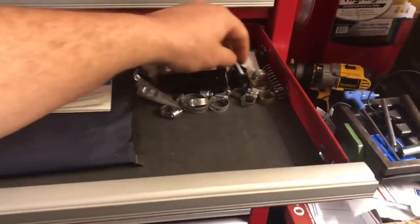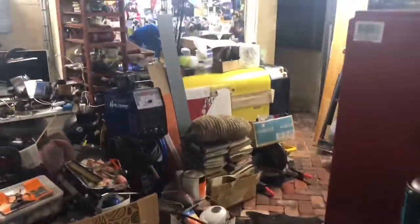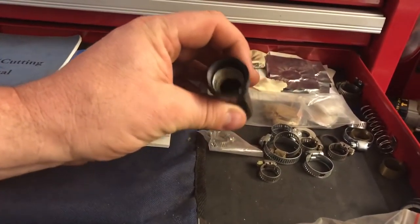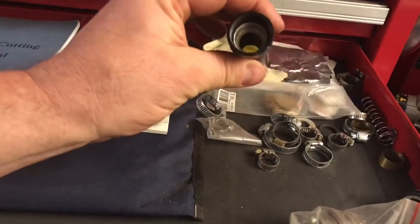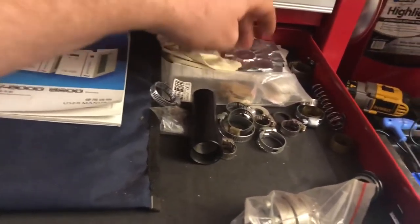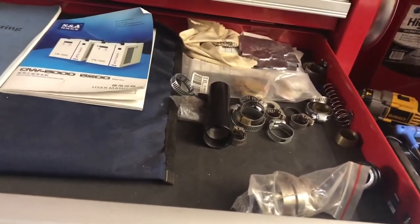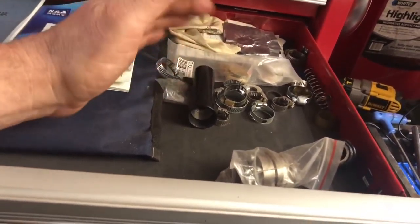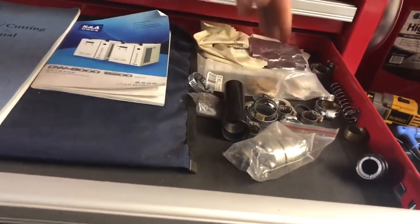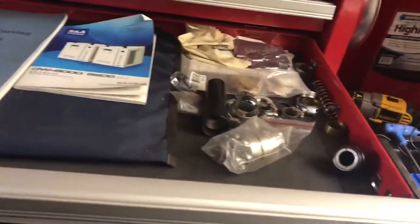Laser, various other things for the laser cutter, the yellow box over there. So I've got exchange mirrors, exchange lenses, various other fittings and fixtures. And now that I've got a lathe, I can actually do what I was planning to do with this, which is set up a range of noses for swapping in the lenses, different focal lengths. So you have like 40, 50, 65, 85, something like that, which affect the shape of the laser as it comes through the materials. Very handy.